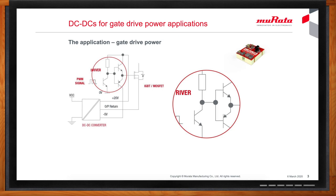When you look at this schematic, the DC to DC converter is what Murata provides. The switch needs to be controlled by pulse width modulated or PWM on-off signals to the gate. With large devices, significant power is needed to do this because of the high gate charge of these power switches. The on-off drive voltages are critical for best efficiency and low EMI, so the gate drive circuit has to be carefully designed and powered correctly. This is where the DC to DC comes in — this slide shows a simplified gate drive circuit for a MOSFET with the gate drive on at plus 20 and off at minus 5 volts for the PWM signal.